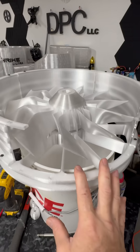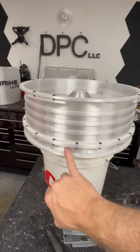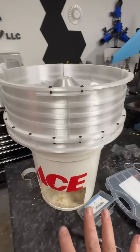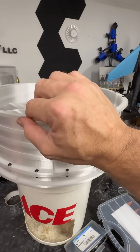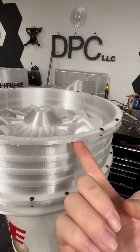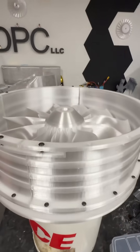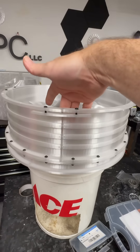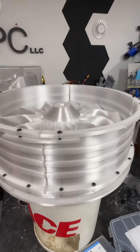Same thing with this engine — last plate will be done today. I'll assemble that on here and do the exact same thing. These will all get run up and tightened; they're just in place at the moment. Then this will get CA glue here, here, here, and here. That'll get run up, I'll run screws through the top plates to hold the nuts in place that I RTV'd to the back side of this, so that when I put my ductwork on I have something to run it into. Before putting the ductwork on, I'll RTV up the inside from out here and smooth it from this side — that seals everything up after everything's seated.